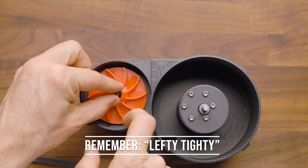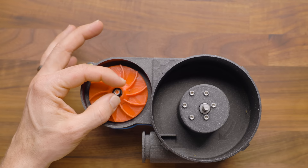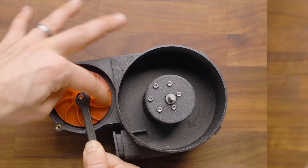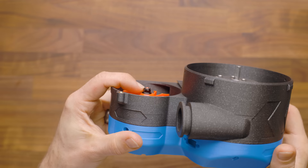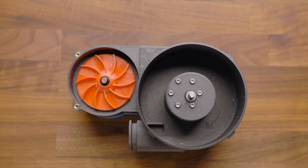There's another indicator that'll tell you you've done it right. I like to just hold the nut and spin this clockwise from this perspective. Then you're going to take your either eight millimeter wrench or grab on here with larger pliers and tighten it further. You'll feel it get tighter — that's when you know you're good. The top of that shaft is just barely maybe one millimeter going to break the surface of that nut, and that's when you know you've got that right. Give it a few spins, and it should feel nice and smooth.